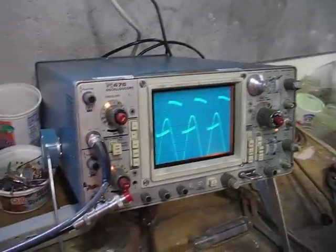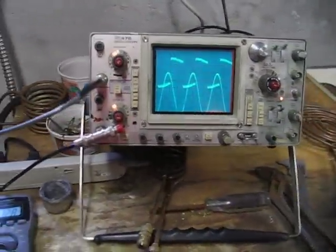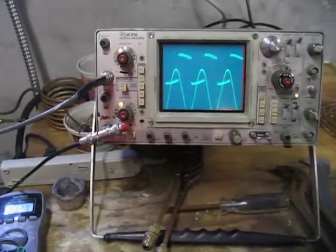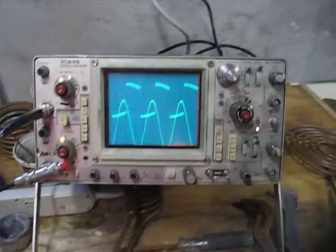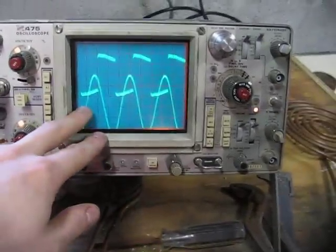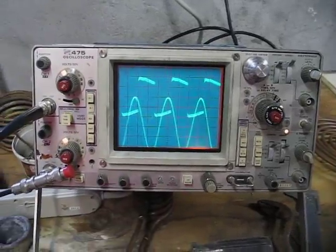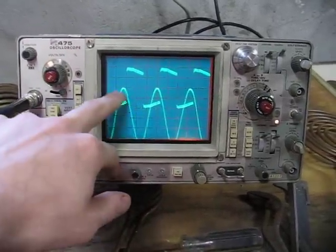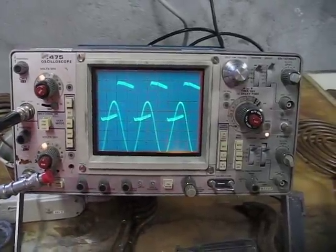Now it's off right now. I've got my oscilloscope here, so I'll start it. I don't know if you can hear that, but it's got a horrible high-pitched whine, so if you want to make one of these things, I recommend ear protection. So right now we've got 20 amps per div — so we've got 20, 40, 60 amps peak. A little bit of phase shift, so it's not full power factor, but it's running something.